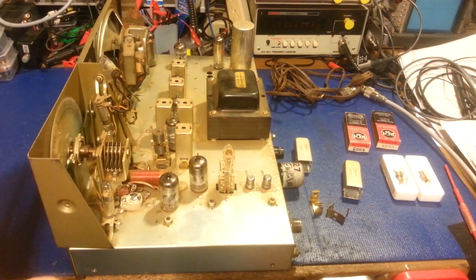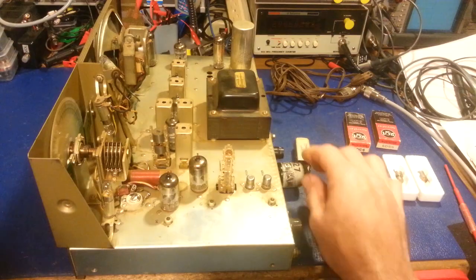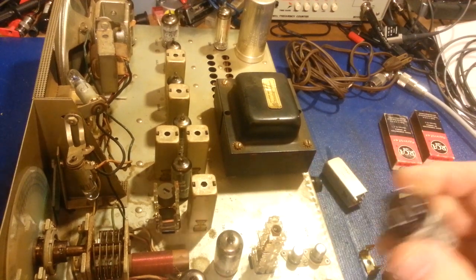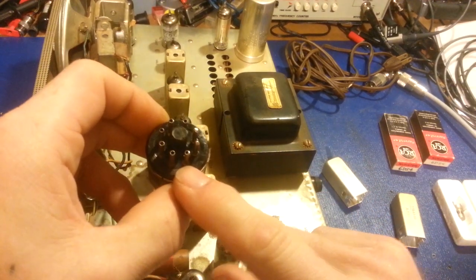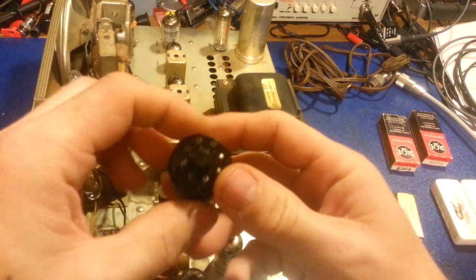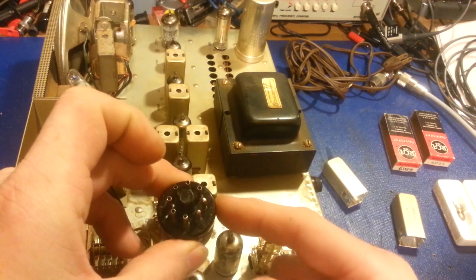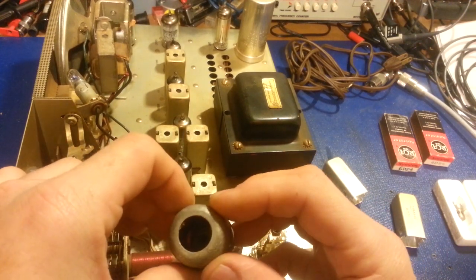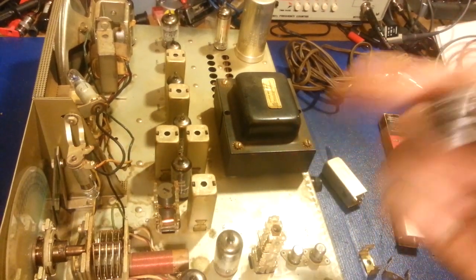That's not a problem with these radios. What you can do - since the only thing in the transmitter needed to make this work is a set of relay contacts - is make a jumper plug. I've had one of these for years, and it's marked 'Browning R27' because that's what it's used for. You take an eight-pin octal socket and just put a jumper wire between pins four and five. The pin numbers are clearly marked on these sockets. Just put a jumper wire on the inside - that little piece of red wire you see in there, that's all it is.